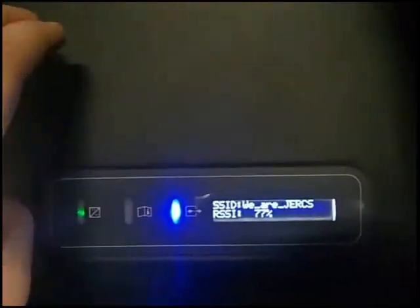Now over to the other inverter. The lower roof has just two strings, and they're going to be fine. I'm in the 200s range for each of both of them. And zero on String C, which makes sense because there is no String C on this one.